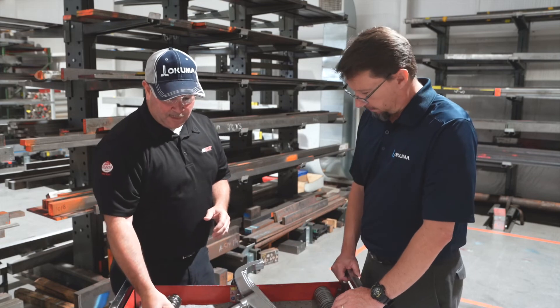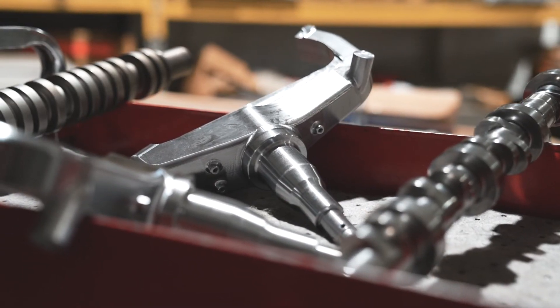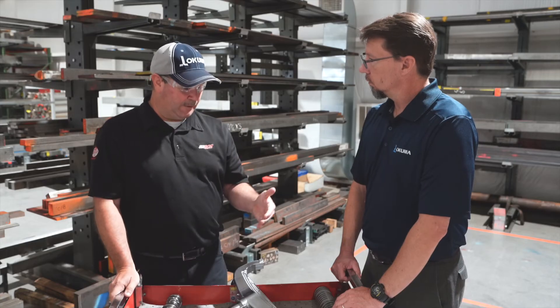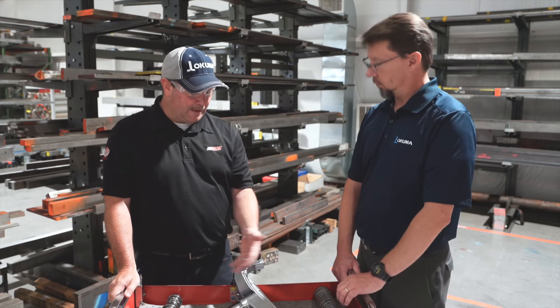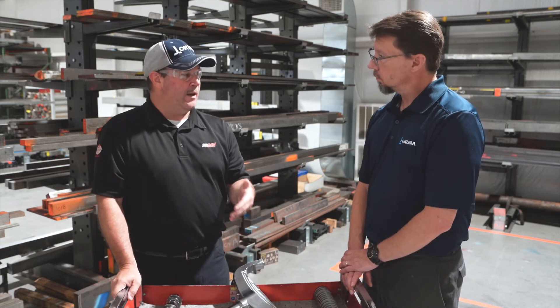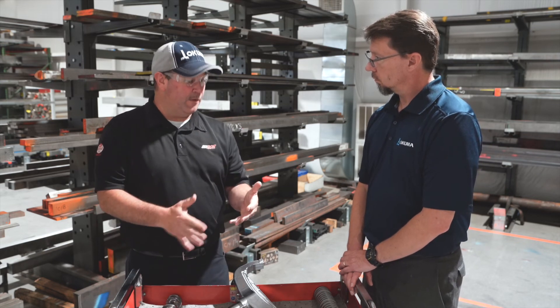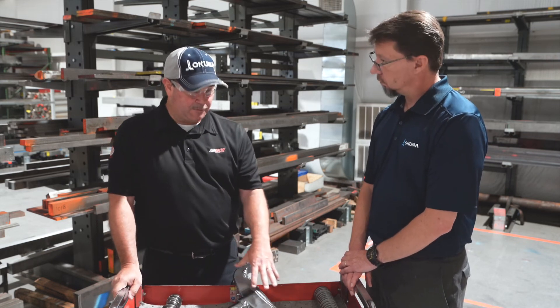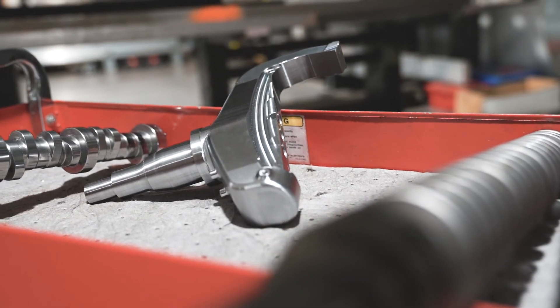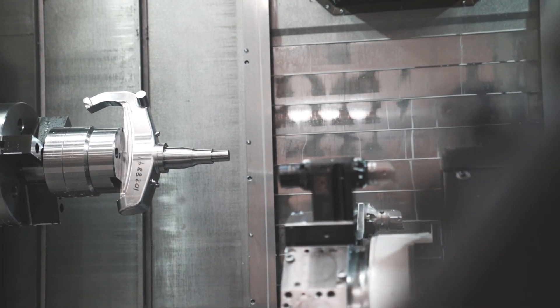Tell me a little bit about the spindle that we're looking at. Several years ago, a lot of the geometry on the spindle side started falling outside of the common forging that a lot of the teams were buying. Everybody for years had used the forging — you've seen the top ball joint and the bottom ball joint with a forged arm that you machined and then welded together. Several years ago the geometry started falling outside of that, the supplier dwindled down their inventory, and we had to go to billet. The timing worked out pretty much exactly perfectly — we migrated to billet spindles at about the same time we got the Multus machine.